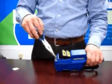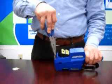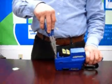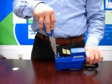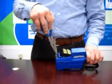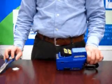What I'll do initially is make that piece of plastic a little more elastic — I'll push on that groove area about 10 to 15 times just to give it some elasticity. You'll only need to do this the first few times you change the ink rollers on this gun. Once you become an expert and the gun has been used well, that piece becomes a little bit less brittle.